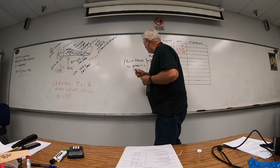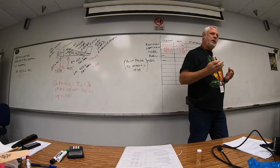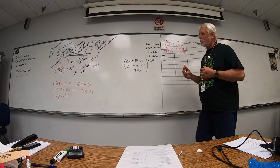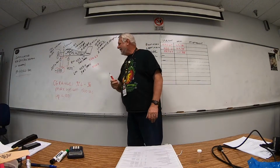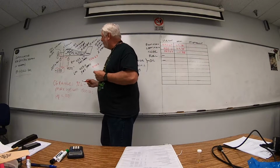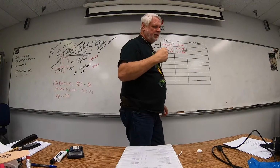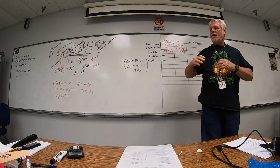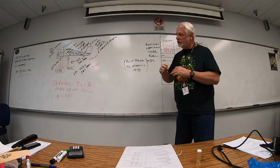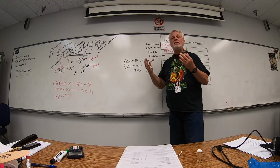So if you've heard me through the wall, take the fuel out. You can either drain it, that would be the best choice. The second best choice is to top it off completely, then we know exactly what it has in there. The third choice, which isn't quite as desirable, is to put a stick in the fuel tanks and find out how much fuel you have. Then it's simply a ratio. If you know your tank was 10 inches deep, I'm going to use that number, it wouldn't be that deep on a Cessna 150, I promise. But if it was, and it was 5 inches on the stick, you know you're 50% full.